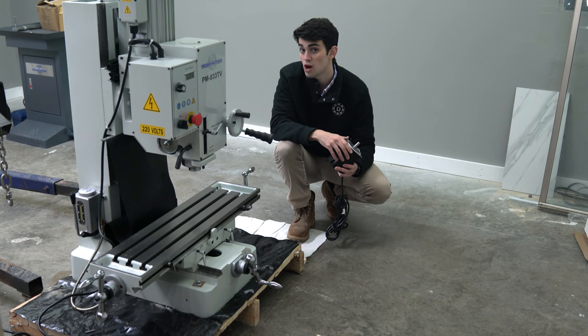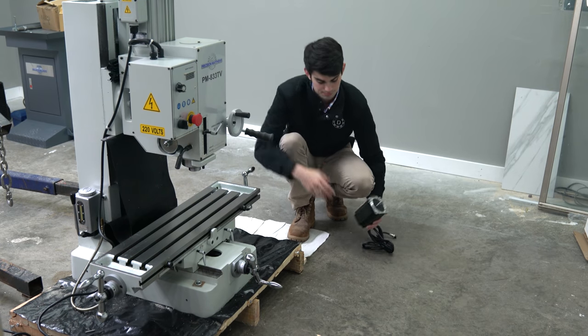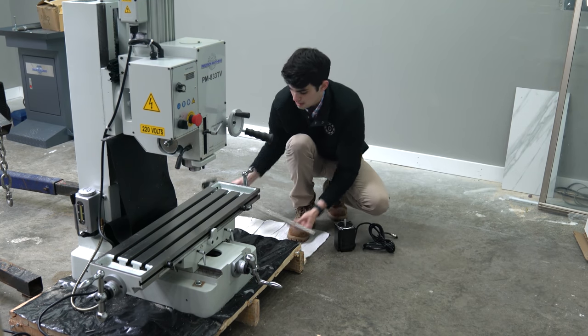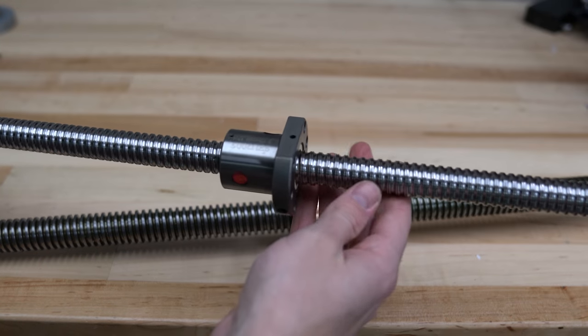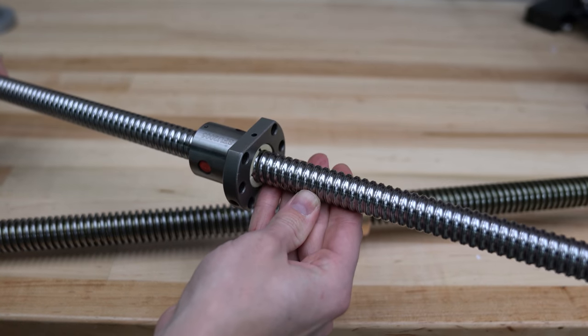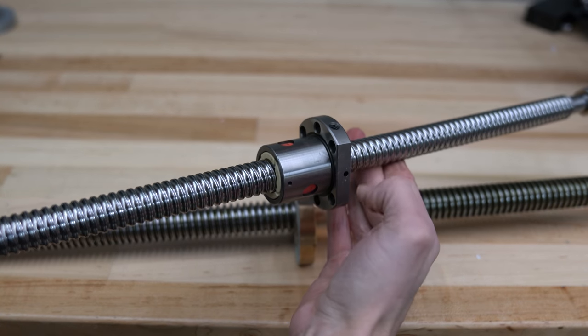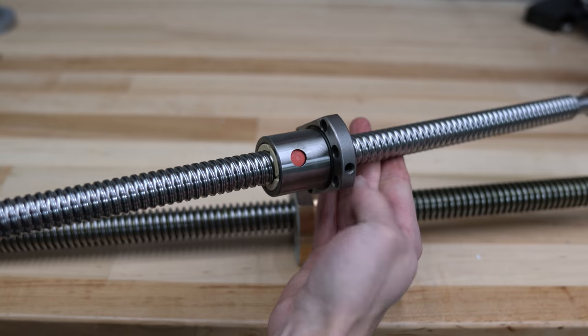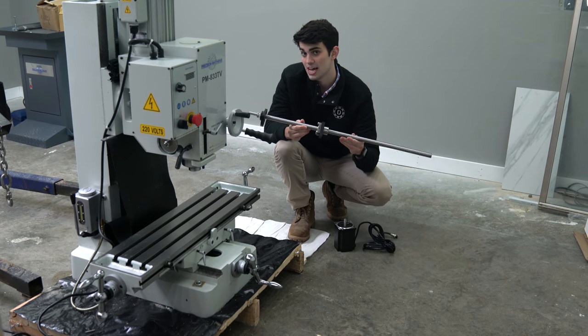It is better to use a drive system that has very little, if any, backlash, like a ball screw. A ball screw may look like a normal screw, but the threads are designed to act like helical raceways for the ball bearings found within this special nut. To substitute the 833T's lead screws for ball screws, we have to take apart each axis.